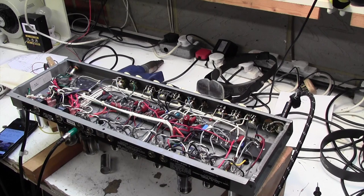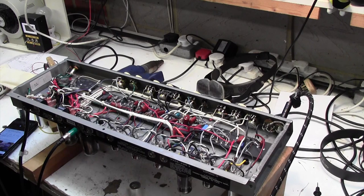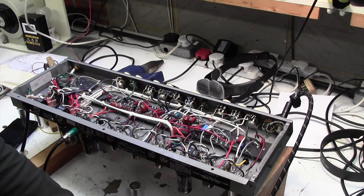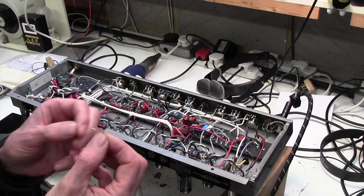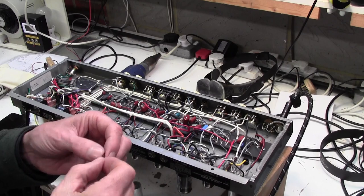And it's on. You can hear the tick, tick, tick, tick, tick. No noise yet. Obviously, we'll leave it a little while because the noise did only come after it warmed up. But I'm feeling quietly confident that problem one on this amp might be solved, the most difficult problem. The other thing I might do, just for fun, is to get the mega on this capacitor and see if it's leaky at all. That might be fun.